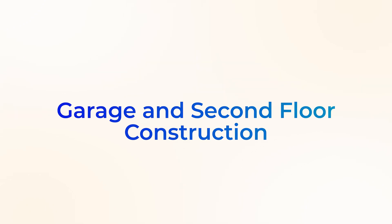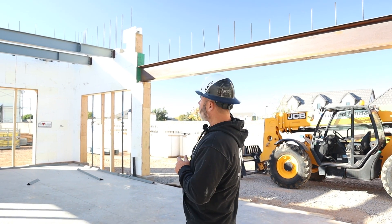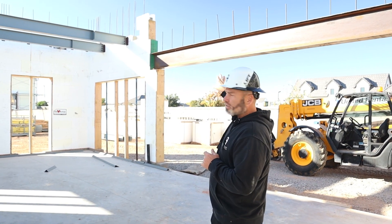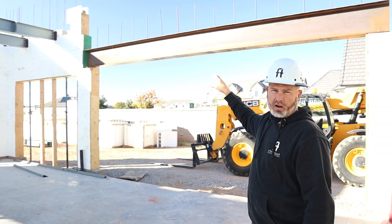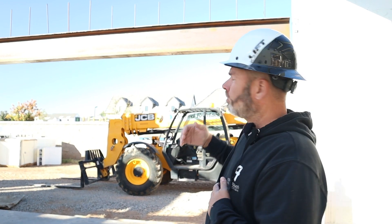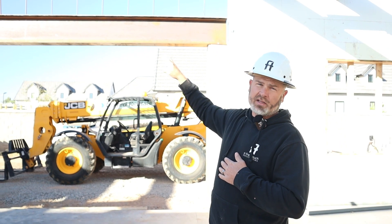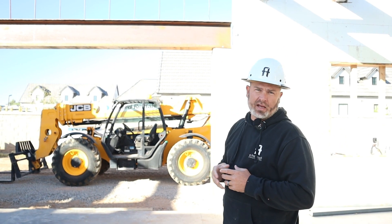Over here at Liberty Estate, I'm standing in the garage. Notice the difference in this beam compared to the one over the garage — the guys at Alignment Steel have welded a bunch of rebar on here for me. Now that we have this beam in over the largest span of the garage, we're going to add some more ICF Fox Blocks, stack it up, add the embeds, and then put our remaining five beams on and continue on with the second floor on this side.